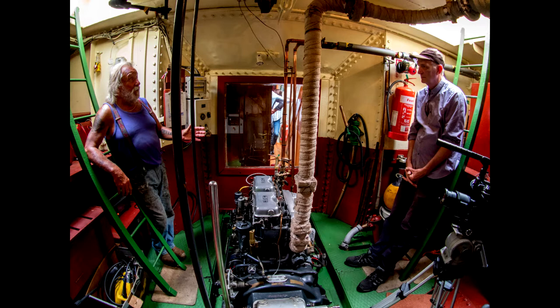You look in that glass eye there and you can see the flapper in the eye go up and down, and that shows you the water circulating. So it goes around the engine, cools it down — and there's a thermometer there — then it goes back out and over the side. So it comes in, through the engine, circulates, cools it down, and back out through there.